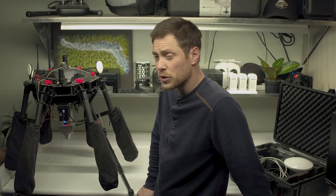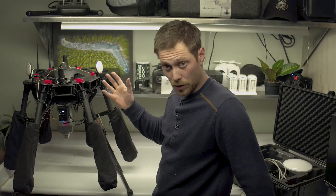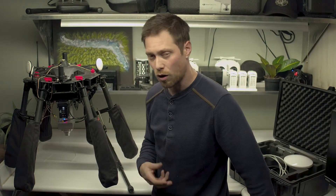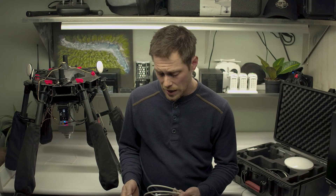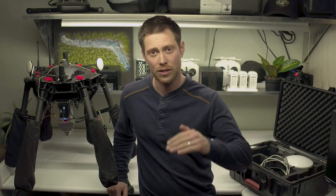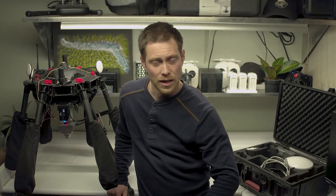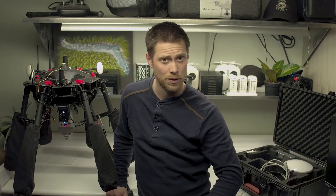On the first time, you'll want to identify how you want the system to start its data collection. Once all the lights go blue and your drone is powered on and ready to fly, press the power button — just one quick click — and that lights up your record light, meaning it's armed and ready to record. But before that, plug the sensor into your laptop via network cable. Log in through the browser and set up one of three data collection modes: by speed, once it reaches a certain speed it'll start recording; or by height, once it reaches a certain altitude it'll start recording and stop when you come back down.